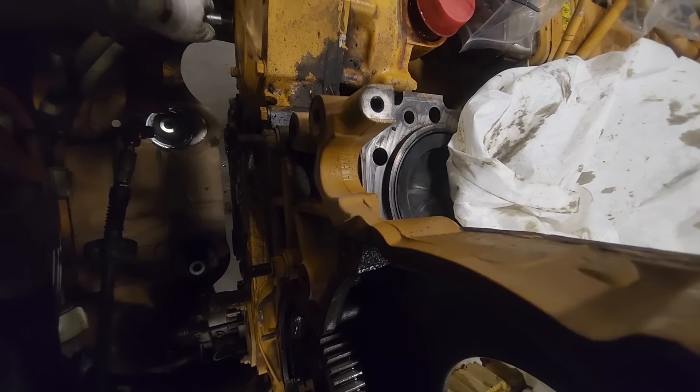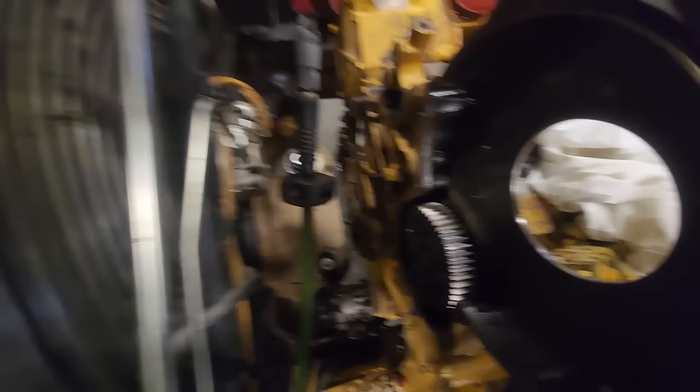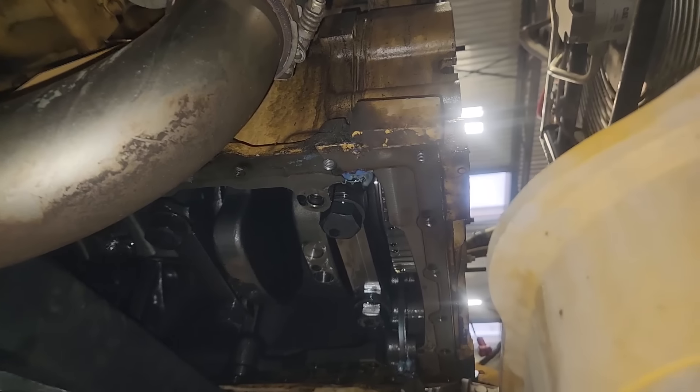Now these bolts had so much paint on them - we have so much paint on the bolt that you can't even get your worn-out 9/16 socket on it. Pain in the butt. And these are the water pump bolts. So the water pump bolts actually seal the front structure, at least part of it - they sandwich what they call the backing plate to the front structure through the water pump. You know where you get the bolt loose and then it runs the gun back but you can't get the bolt all the way out because there's a guard in the way. You might say, well, you should have pulled that cooling package. You'd have to evac the AC, then pull the whole cooling package out - it's got hydraulic oil going to it so you'd have to cap those lines. There's a couple different coolers, like a fuel cooler also.